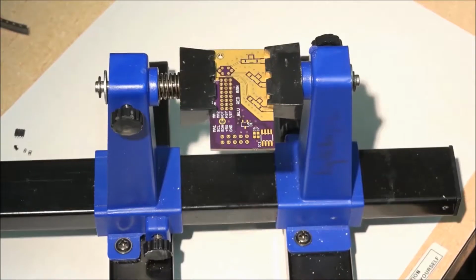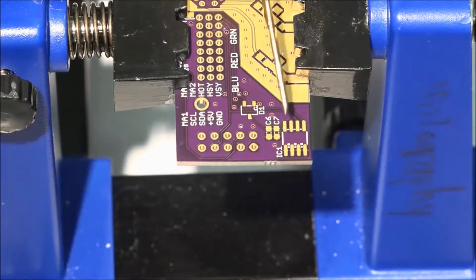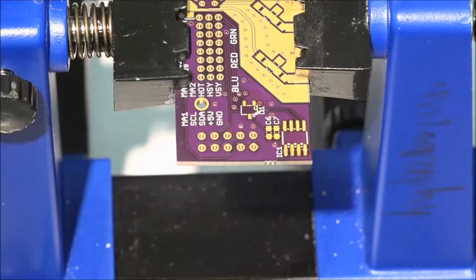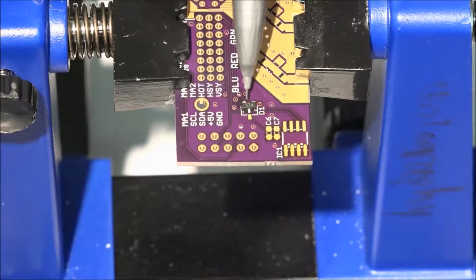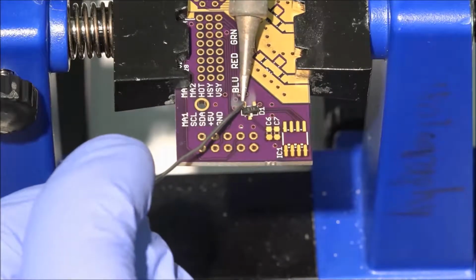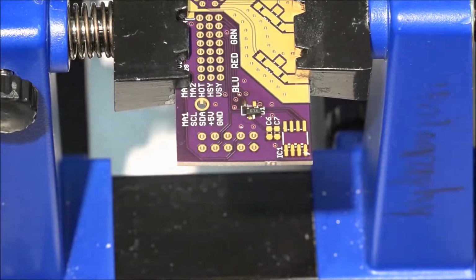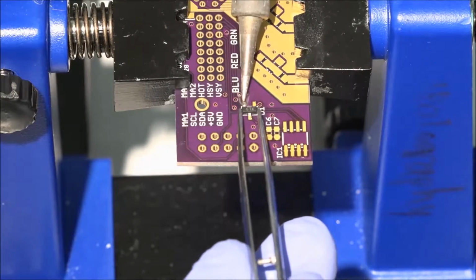We'll start by soldering the small surface mount components first. Apply some flux to help the solder flow onto the contact points and transfer the heat. You may need to use some pins and tweezers to place the small parts, such as this Schottky diode array. You should tin or solder one pad first to act as an anchor point for a part. Solder the anchor point after aligning the part, then solder the outer legs.